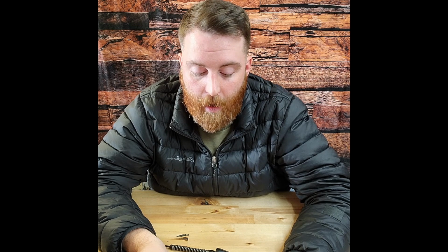So it can make a good part, but one of the problems is it can get air pockets and stuff like that in there, and if you get a void in there, it can create a weak point and it can break. And so it's something you don't run into usually with billet parts. I mean, you can still get a void in a billet and it can still break, but with metal injection molding, it seems to happen a little bit more often.